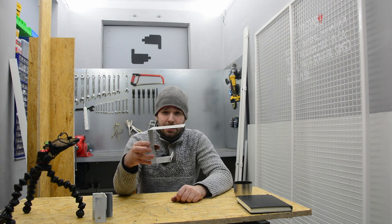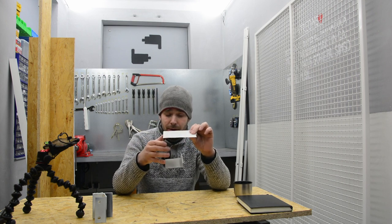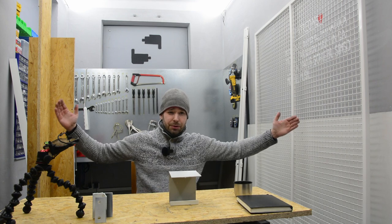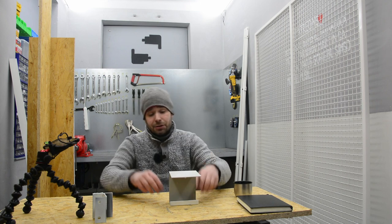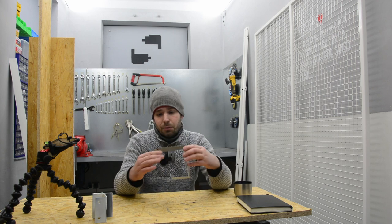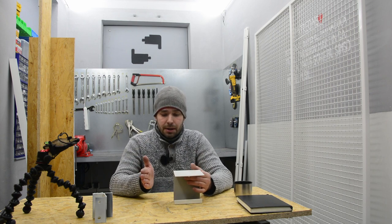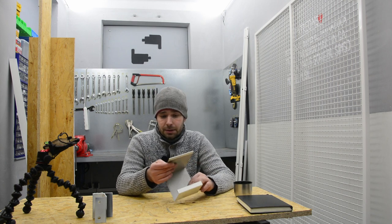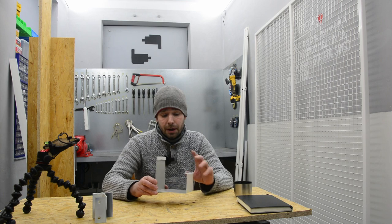So this is the side view of the enclosure, and despite being only half a millimeter thick, it's quite rigid. The whole enclosure has to be 320 centimeters wide, and the bender is only 170, so I will divide it into two enclosures, and they will be connected together. On either side I will add flaps, about 15 millimeters wide, used as a connecting plate, so I can push two of these enclosures together and from the inside maybe put a rivet like this one, or maybe some screw. I'm not sure. I have to do some tests.